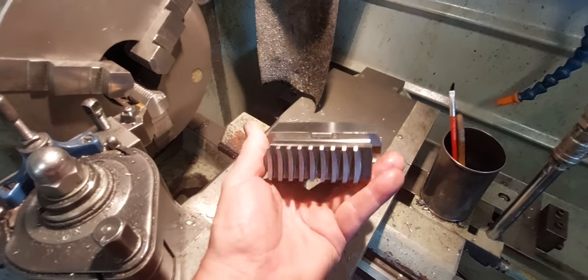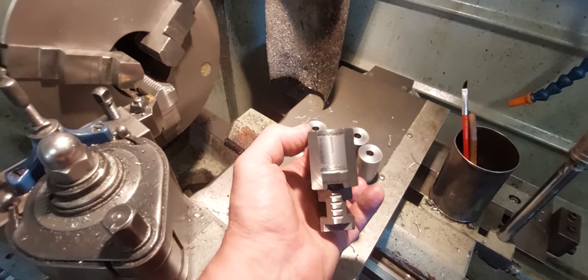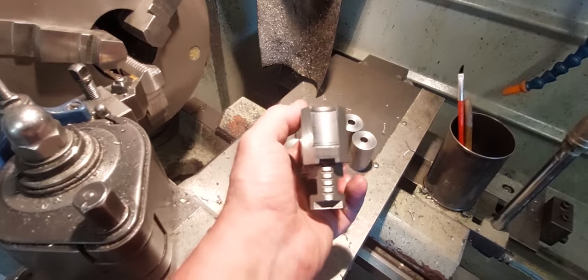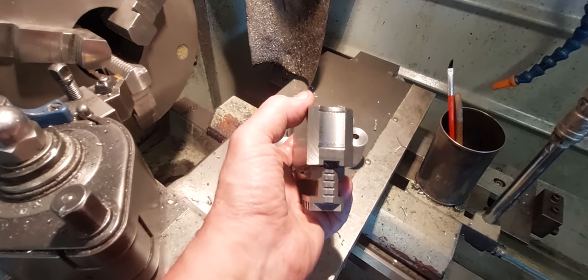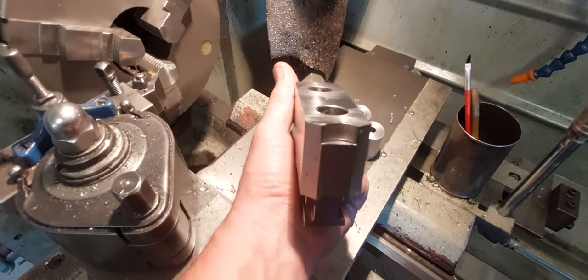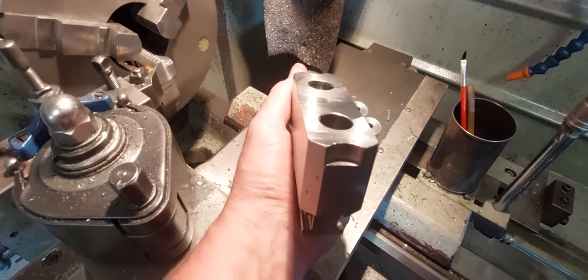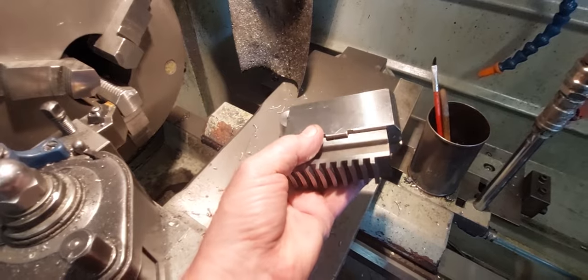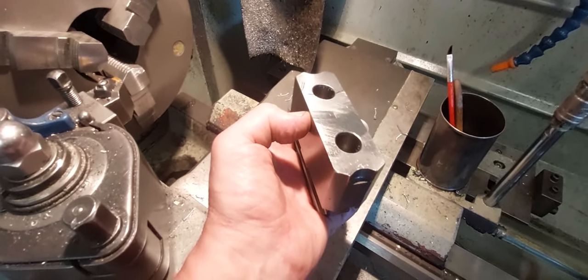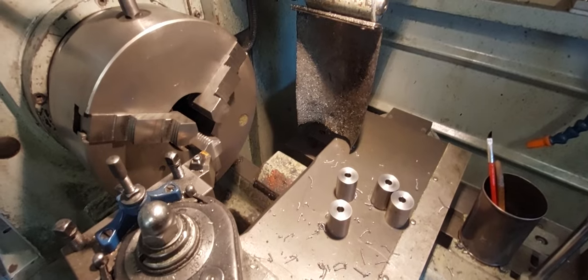These soft jaws aren't from the CNC lathe, as you can probably tell from what's mounted on the bottom. I have different size cuts in here for different size parts I'm doing multiples of. I don't do much of it now because that work usually goes over to the CNC lathe. But this is one way to hold parts and keep your length consistent — the part bottoms out on a shoulder. They're varying sizes for parts I've made. They're a machinable grade steel and you can make these yourself out of bar stock. I stamp a number on top so they correspond to a particular chuck position, same as a CNC lathe.